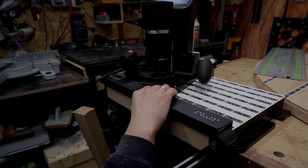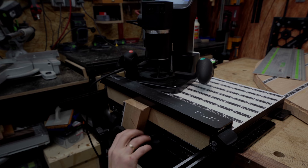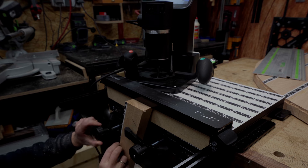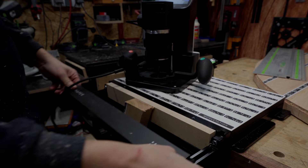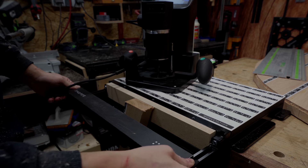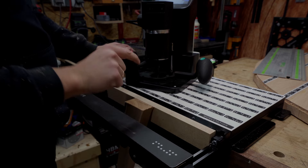This here is an alignment bar so you can make it nice and flush and level with the top — push it against this one. Then I'm gonna bring the clamps in and clamp it really tight. I'm gonna remove this, bring this bar here as a support bar for my Shaper, and now I'm gonna set out my mortise on this one.